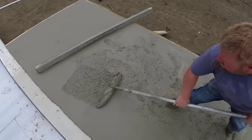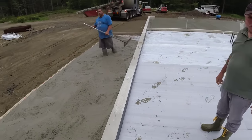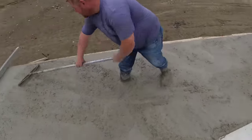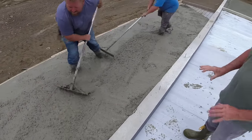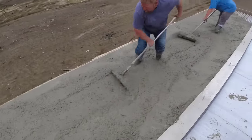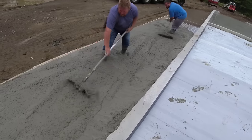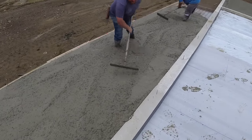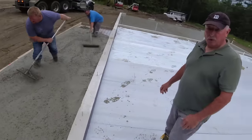That sucks. That other one, we ended up pouring it dead flat because they never pitched their wall. So I ended up raising the door. I ended up putting a small steel plate under the door and then drug it in. Weren't you going back and overlaying that or something? He never called. Well, I left it like that just in case you did. You had talked about maybe coming back to overlay and stamp it. When you get there, that door is already up to 3/8.